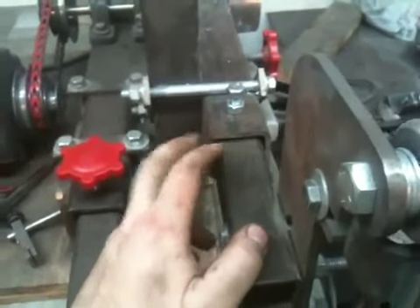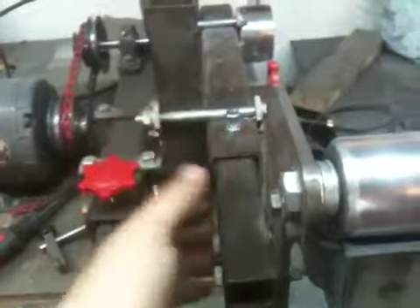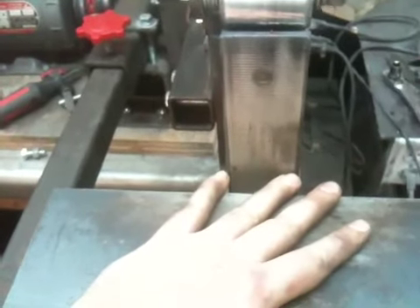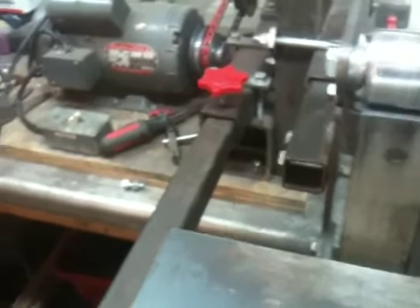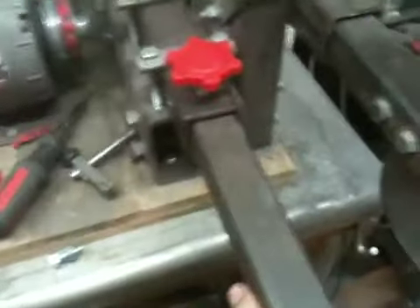You're also going to have that issue up top. Since the adjustment arm is on the right side, instead of moving left and right and getting play that way, I would have up and down play. If I were really to bear into this or maybe tighten the belt up too much, it would actually pull the platen up just a little bit and change that angle ever so slightly — either on the flat platen or the contact wheel. In the grand scheme of things, that really leads to poor precision, poor repeatability, and introduces a number of problems that I found can be easily remedied. I was looking at the design, looking at the play, and just figured out a real quick and easy fix for tightening up these wobbly arms.